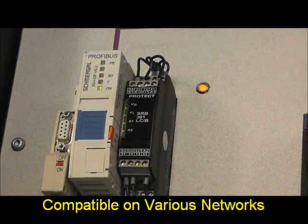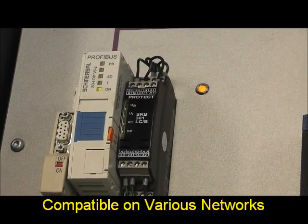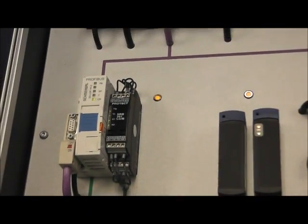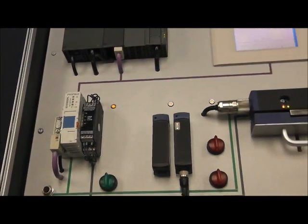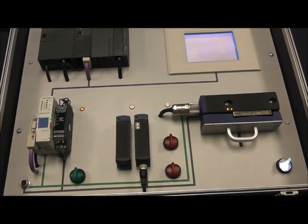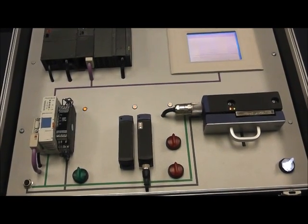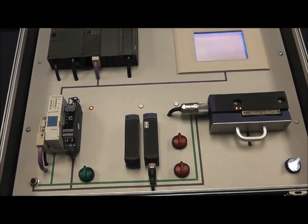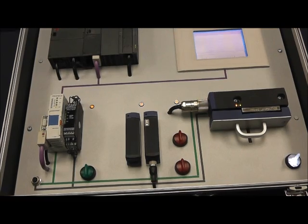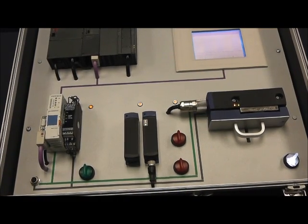Many serial diagnostic gateways are available, including PROFIBUS, PROFINET, DEVICENET, ETHERNET IP, CCLINK, and CANOPEN. The diagnostic signals are evaluated through the control system, including warnings for overheating or cross-short detection. Operational conditions can be read and control commands, such as unlocking a solenoid interlock installed on the series wire chain, can be transmitted.